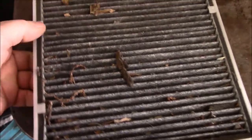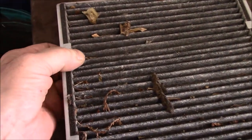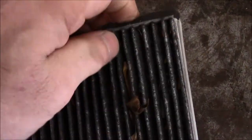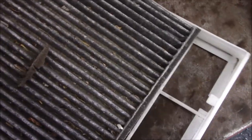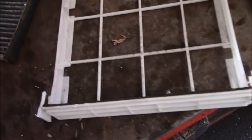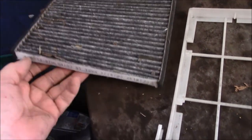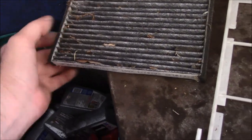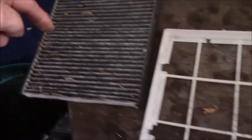You have these little tabs right here and you need to get that filter past these little tabs. You would pull it in just like this and pull it up like that, and take it out just like this. Now, filters are directional. If you look at this filter — we're not going to use it as an example because somebody put it in upside down. You see how that arrow faces up? That arrow was supposed to be facing down — the flow of air goes through this way. Somebody put that in wrong already.